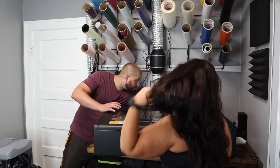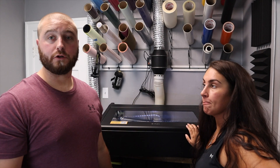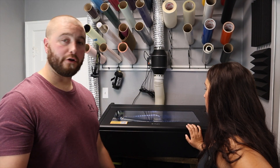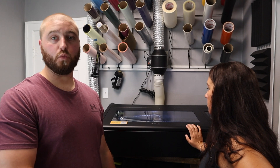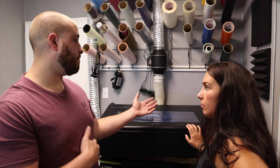Hit that power button. One thing I will say is if we are going to keep this machine, we're going to add an external water reservoir. For longer cuts it seems like the water is getting warmer, which obviously makes sense, but I just want to make sure we are circulating cold water to keep the laser tube cold and not have any of those issues.